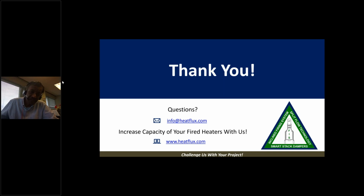Can you apply this technology to crude atmospheric furnaces? Yes, we are working with two of our clients on applying this technology to crude heaters. We have done the engineering study. We have also done the PDB study. So we are just waiting for the execution. And there, what we are trying to do is to reduce the pressure drop. And the split flow basically offers us a way to shift heat from the radiant to the convection. So one of the things we are doing there is trying to lower the heat flux.